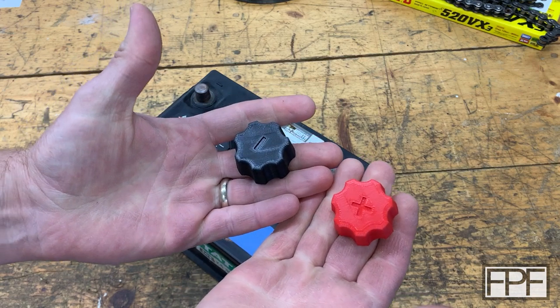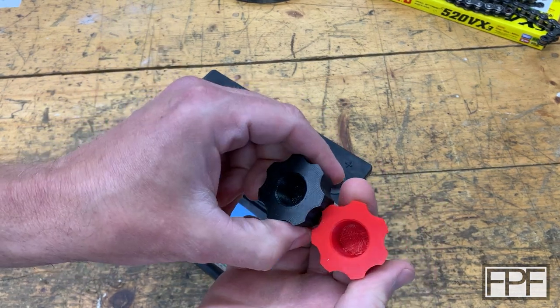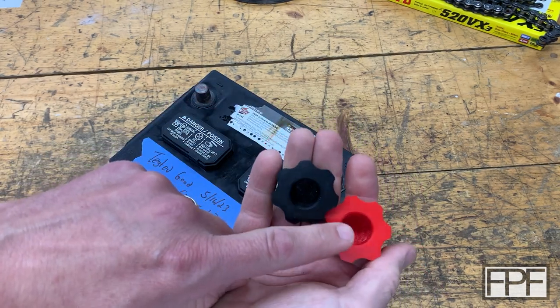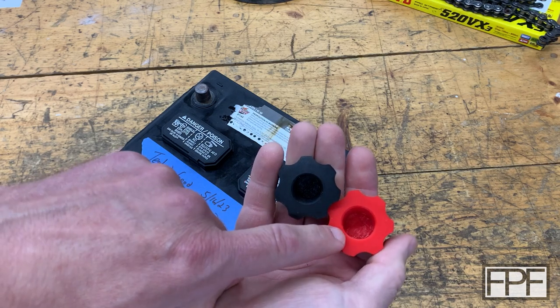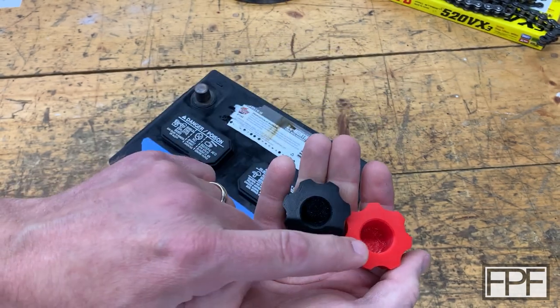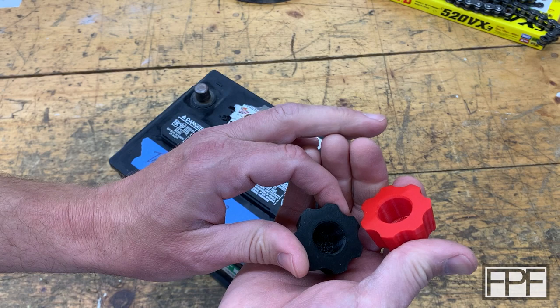These were a bit of a pain to do, so I'm hoping this works on the first try and that the taper measurements were correct from that diagram. I'm going to go slice this up and let's get them printed. Here we go — I did one of each and I think they came out pretty nice. I let it just bridge across the top. If I have bridging across the top that's a little bit messy for the first couple of layers, I just take a flathead screwdriver and rotate it around in there almost like a chisel to just break any loose pieces off. Let's see how these fit — they definitely look good.